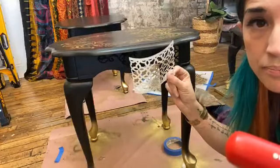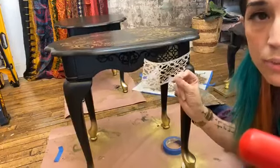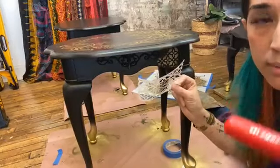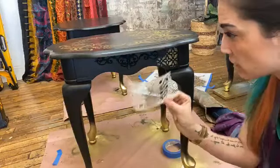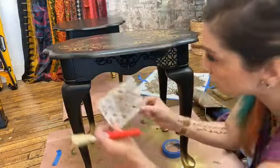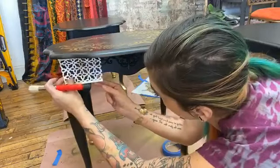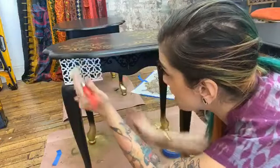Yes, my favorite. Marta, this is going to be my last step. These waxes dry hard and permanent. So I've already sealed my pieces here and my gilding wax is last. The decor wax is oil-based, dries or cures hard, permanent. You can seal it if you'd like, but make sure you let it dry or cure at least overnight, in my opinion. It dries very quickly, but I would let it cure before you put any sort of sealer over it personally. So we're just gonna reuse that bad boy over here.